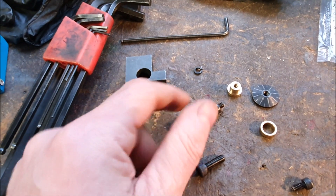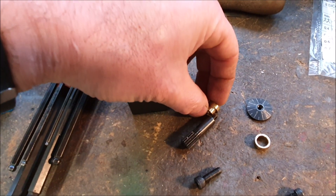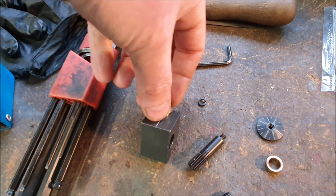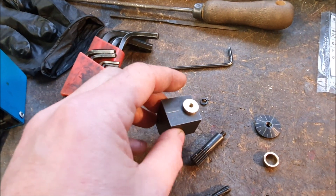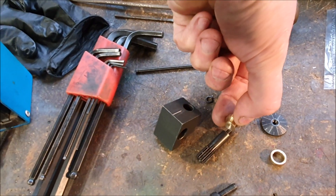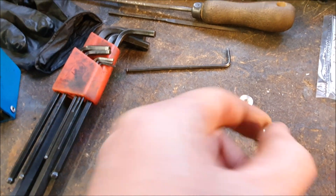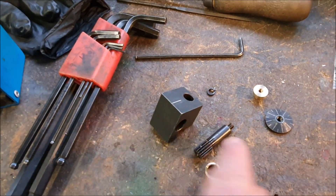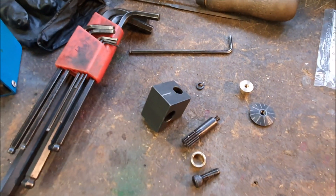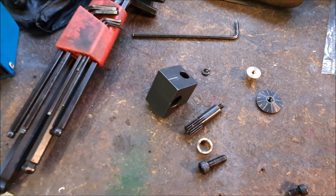What I've done is machined up from brass a little extension that fits on here and that fits neatly into the hole in the block. It's threaded all the way through, just an M4 thread. I also made a little brass collar which fits down the end of the gear just to take up any up and down slack, and all that does is move this gear down so it engages with the lead screw a lot better.